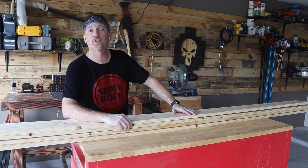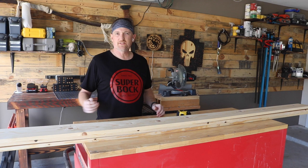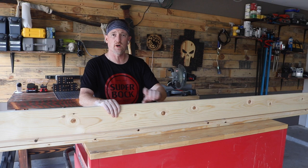On this episode, we're going to be building an American flag out of wood and staining it with fire. We're going to need 13 slats to make up our flag. Those slats are going to be 37 inches long and 1.5 inches wide. I can cut 6 of those out of 1 8-foot 1x6. So we're going to cut these down to that strip size and go from there.